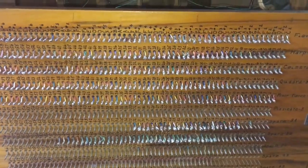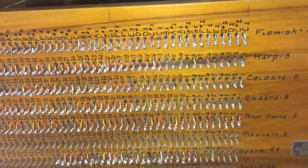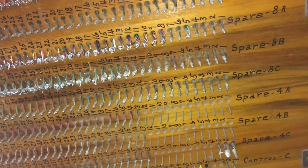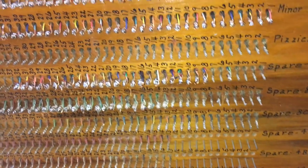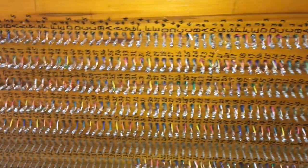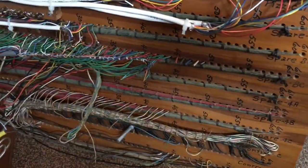This is the junction panel where the bells are wired in. There are 61 columns — one for each note on the keyboard — and a row for each of the different types of bells. There's some names that are unfamiliar, like 'pizzicato,' which I think may have been an experimental bell type that never saw the light of day. Some of the rows are labeled 'spare,' but they do correlate to a named stop tab on the front and they do bring in a set of bells, though there are a few rows here that are actually unused.